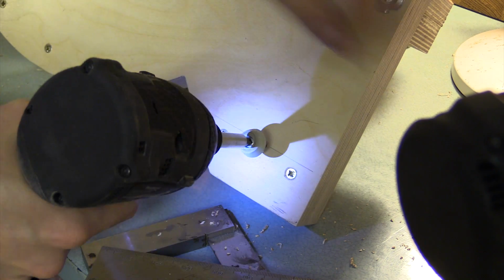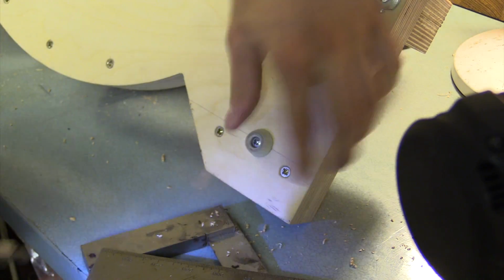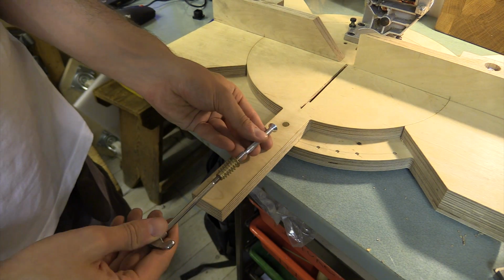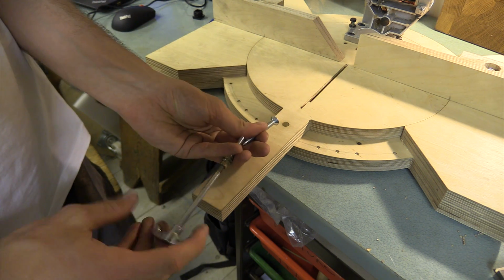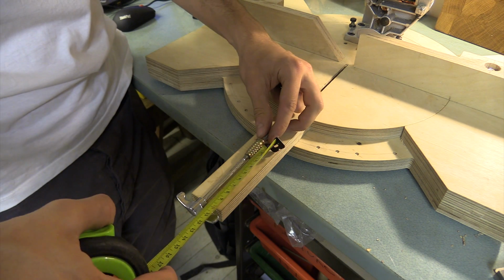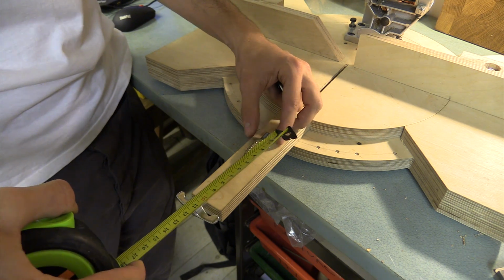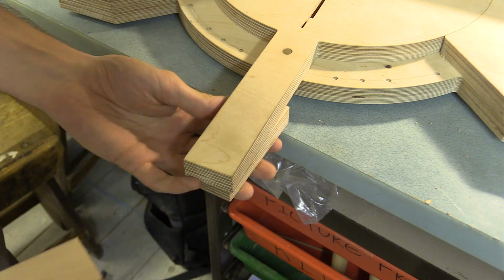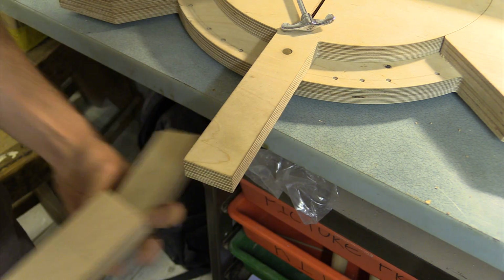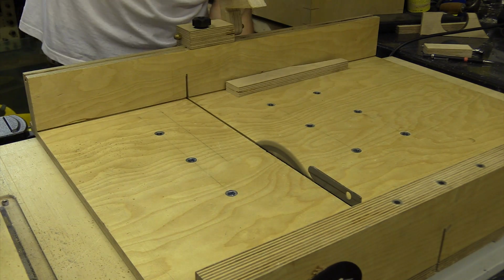I then add a number of rubber feet to the bottom of the base and prepare to start the pivot locking mechanism. I want to keep it simple, so I'm using a threaded tensioning rod from a tom drum. I happened to salvage these some time ago. The handle is simple but decorative, and the shaft is long enough to pass through a wood insert with space to push a tightening bolt, the full length of the handle.